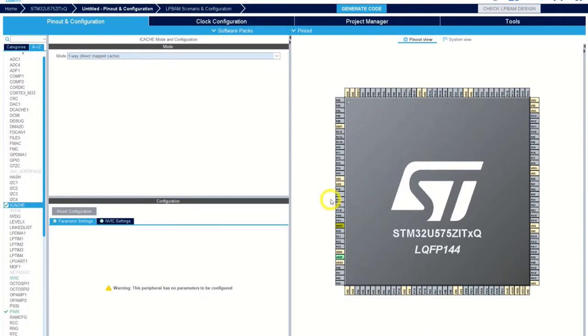We also want to configure the GPIO for the green LED. On this board it's assigned to PC7. So I left-click on PC7 and choose GPIO output. And we get it here — PC7 as an output.